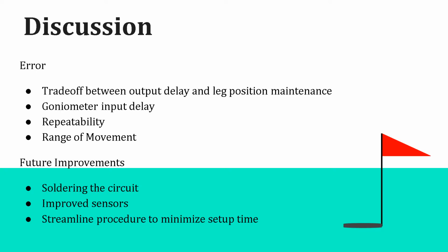Our design had low repeatability over time with the same cockroach leg, as frequencies and voltages that the leg responded to changed over time, or a particular muscle stopped responding after about 20 minutes. There was also a limited range of movement, since there were 3 states the cockroach leg could be in: rest, full extension, or full contraction. Though the servo motor could move to supplement the leg movement, this was a fundamental limitation of our mapping of EMG signals to analog outputs to the cockroach leg. We had greater repeatability between the different legs within the first 20 minutes of setup since we could change the parameters for extension and contraction for each leg.